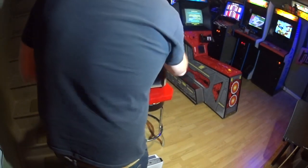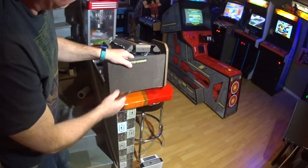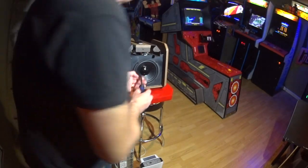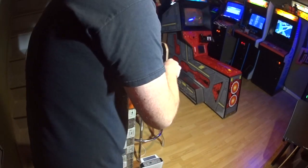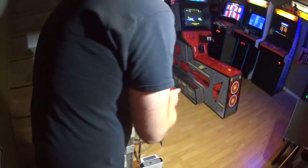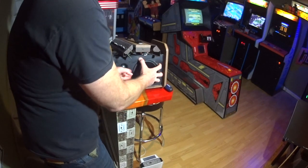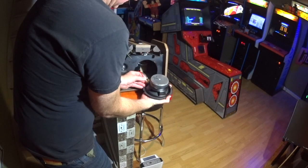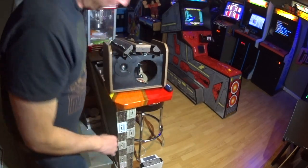And now we're working directly on the front of this. So you see how that grill came right out? There's a little tab that holds it in place, the three screws, you loosen them, and it comes right out. Now we have to take the larger of the two speakers out. The four screws out. Pull it out of the housing, get the woofer out. Two wires, disconnect real easy, boom, boom. Set that aside.